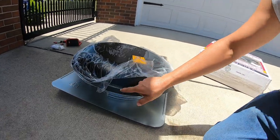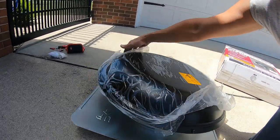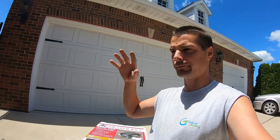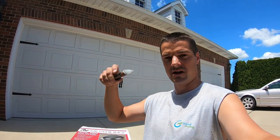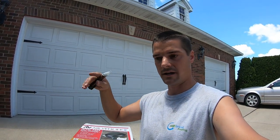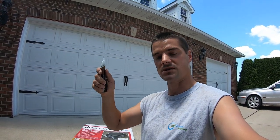You got some bolts around the top dome cap here — you simply remove those. Make sure the power is off. Safety first. You can find one of these cool AC testers on Amazon, link in the description. You're going to make sure it's dead — either a physical switch in your attic or breaker box — just verify the power is off.